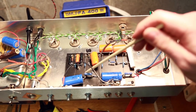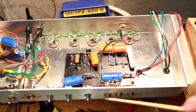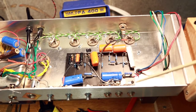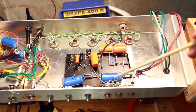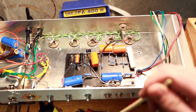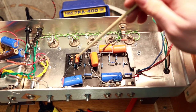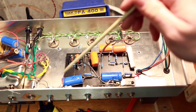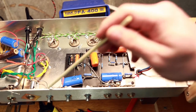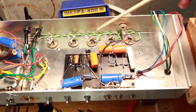I've connected my first input jack here for the mic, and then these two will be the instrument inputs because I'll use them more. I've run the instrument jacks together, each with their 100K resistor, and then over here into the second volume pot. The output of this stage will eventually come down to this cap, then off to this volume pot and over to the treble section.